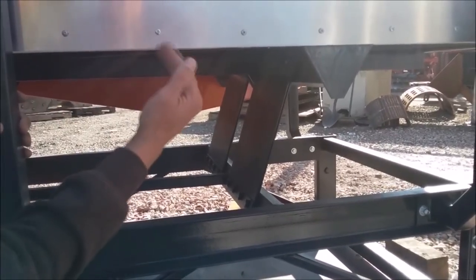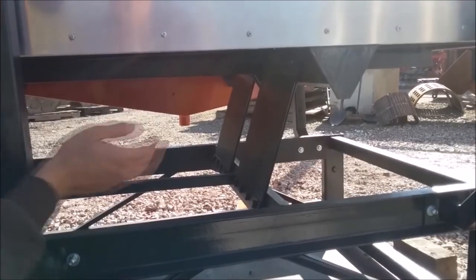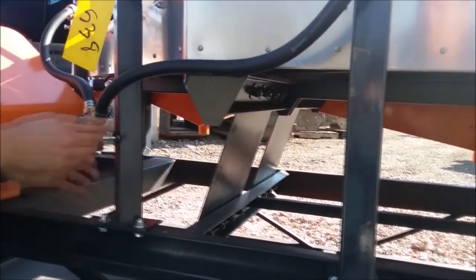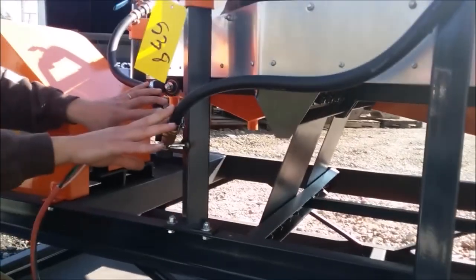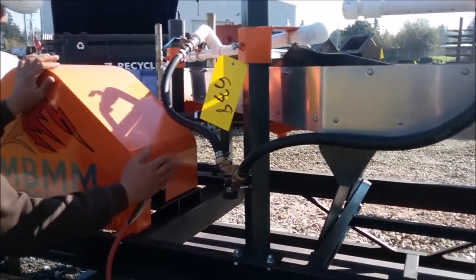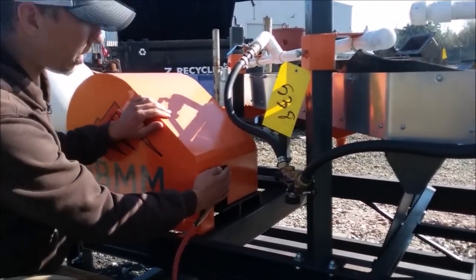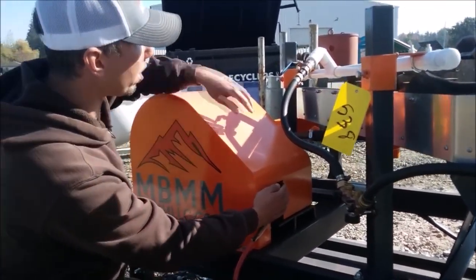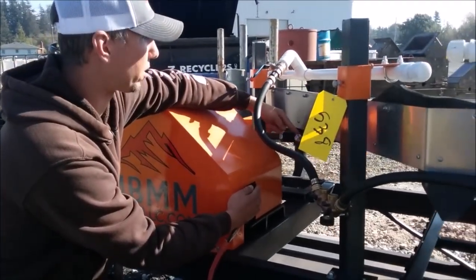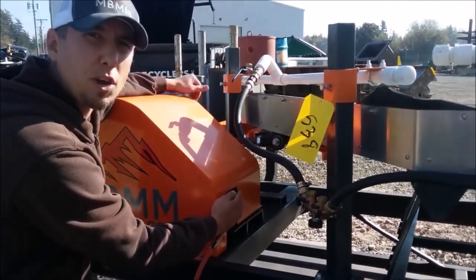If the springs are straight up and down, nothing goes anywhere — it just goes back and forth. As you come across the shaker table towards the high-grade end or the cleaning plane, there's another set of springs. This is the water manifold that goes to the water bars, and finally you come to the drive mechanism for the shaker table. We'll take this guard off so you can see the mechanism — here's the push rod that connects the shaker table top to the drive mechanism.